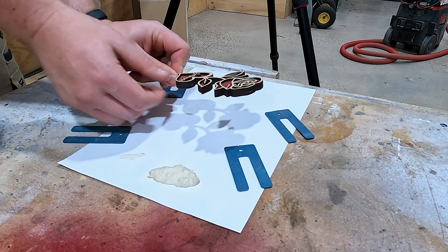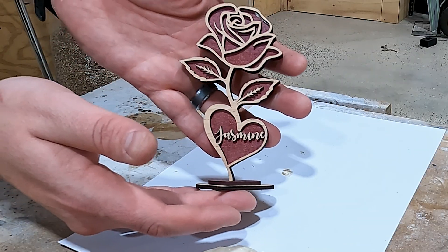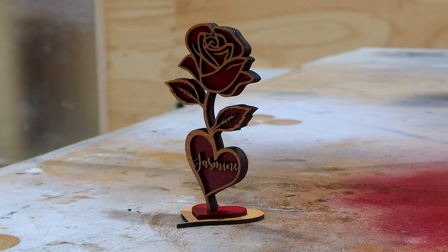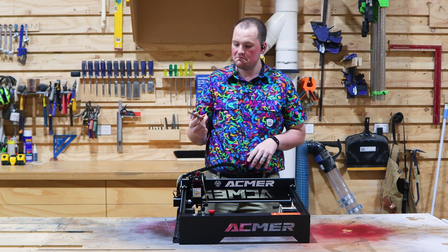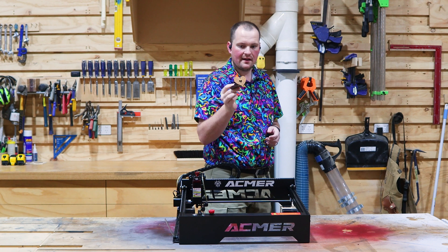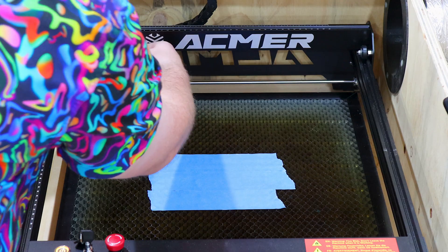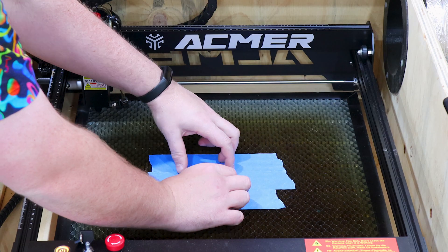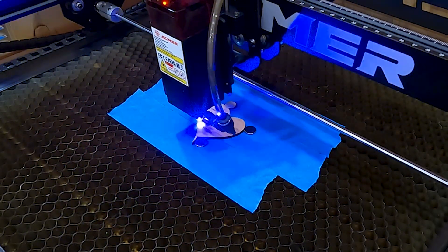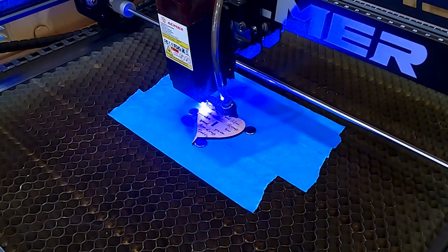I cut out a couple of MDF templates so that when I went to assemble it, I could just snap it all together and knew it was going to be perfectly aligned. Weighed it down with a bag of cement — our high-tech vacuum bag. Once it was all assembled, we gave it a clear coat. Now, I've got a cool little technique for being able to engrave on a part you've already cut out. Take some blue tape and tape it down to your honeycomb bed, then cut. You need to invert the piece, trace it out with a cut, peel the center section of the tape out, then line the piece up, turn the outline off in Lightburn or whatever software you're using, and run that center section — you'll get it perfect every time.